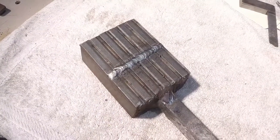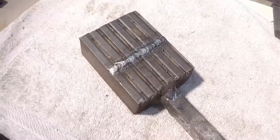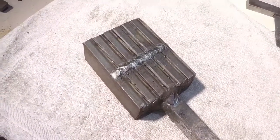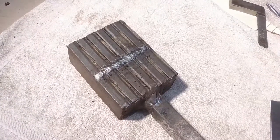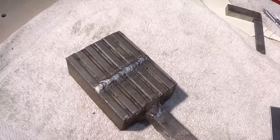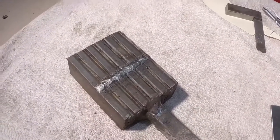And when it gets thinner, I'm going to make it longer. And once it's about 2 feet long and only about as thick as one of those thick pieces of steel there, I'm going to cut it into three pieces, restack it upon itself, and then I'll have 36 layers. And I go through that whole process again.